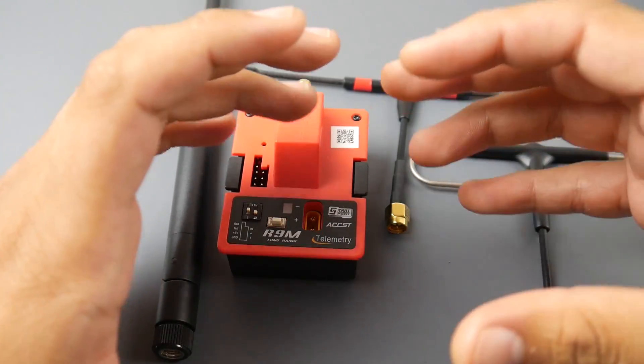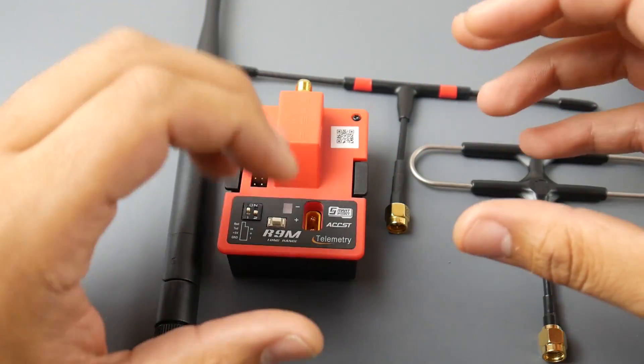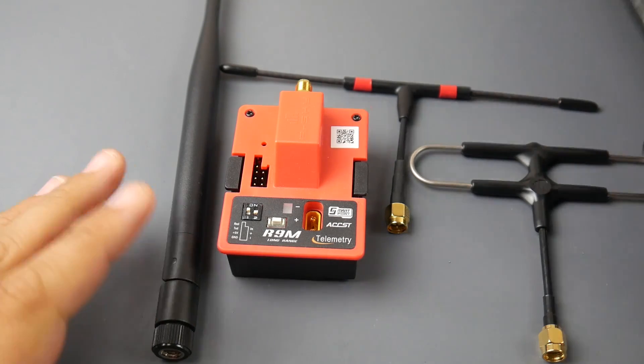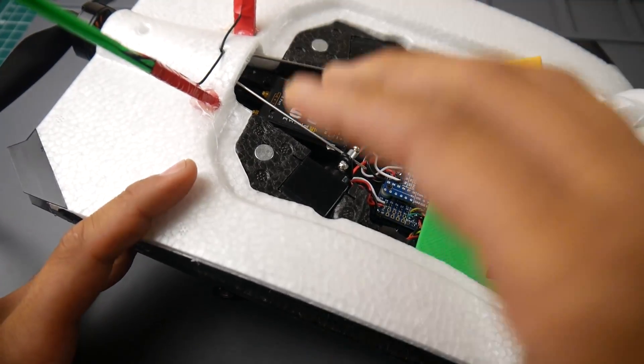It's not because it's louder — it's because the lower the frequency, the further it travels and the better it penetrates. This is why we get so much longer range with the R9M modules, and why I'm picking up so many combos — so I can start transferring most of my models and drones into the R9 system. I've been using it quite often, I've never gotten a failsafe. I've pushed it to a maximum of three kilometers, and the only thing holding me back is battery life. I'm constantly building long-range setups, and my latest is the ZOD Orbit because of its unbelievable efficiency.